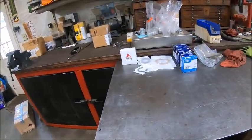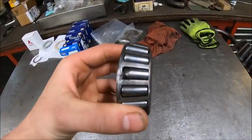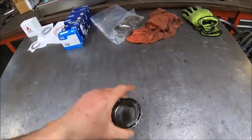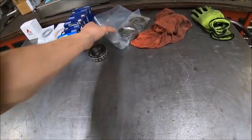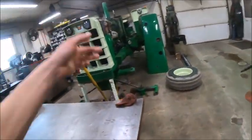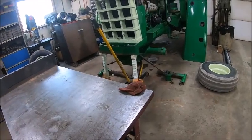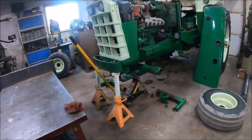and where did I put it? Found this. This is neat. That roller's junk, that roller's junk, that roller's junk, that roller, that roller, that roller, and the cage is stretched. Which threw me for a loop because I could have sworn, because I specifically remember we had this thing sitting down in the barn with the front end jacked up and the wheels off of it, working on the wheel bearings, because we did that when we put the new front tires on it. It had 3 ribs on it and they were shot.